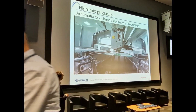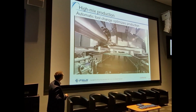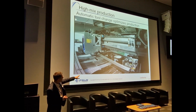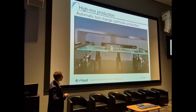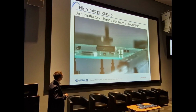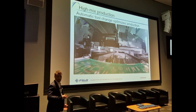This is how the machine changes the tools. This is the DX head, so small parts placed. The machine is going to now change the tool to a different tool, medium-sized parts. So then you're going to see that in a moment. This is the tool change. So this is all it takes for your machine now to place a completely different set of parts of different size. And again, it takes a couple of seconds, and then you're placing with a single nozzle the large parts. It's quite a clever design, all in one, enclosed, one job, one program. You optimize it. It sorts out all your placements and tool changes automatically.